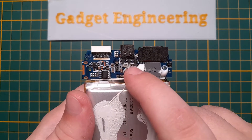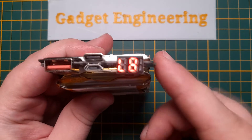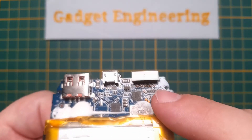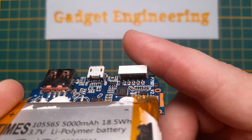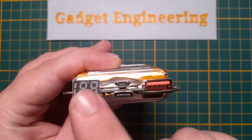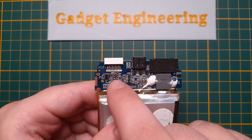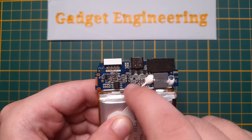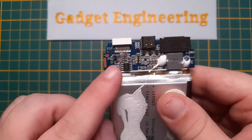Here we have the current sense resistors, the 0.01 ohm resistors. Then there's this fairly curious charge seven-segment display — it's a two-and-a-half digit seven-segment display, but the curious thing is it has only five connector points passing through here, and the whole display just has those five pins. Usually a seven-segment display would need seven pins for the segments plus a cathode or anode for each digit, so you'd expect at least 10 pins. I've probed around and these ground SCL pads do connect to those pins, but I get really weird waveforms on the oscilloscope — they're doing some kind of multiplexing to drive this display through just five pins.